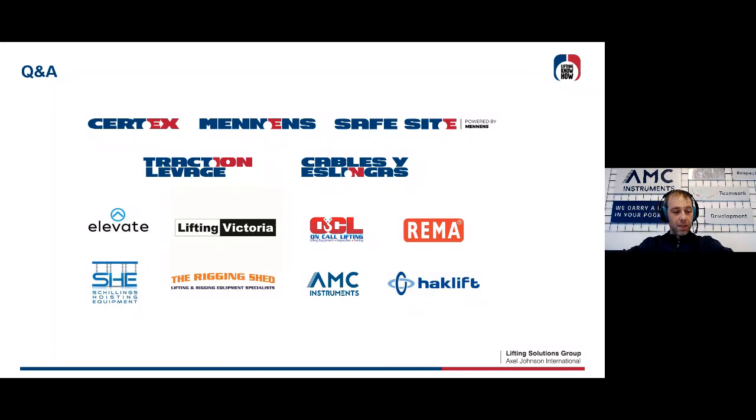Yes, absolutely. The MRT is able to detect both external and internal broken wires, because the effects in terms of leakage flux are more or less the same. So the answer is it is absolutely possible to detect external broken wires, but also corrosion, also wear.